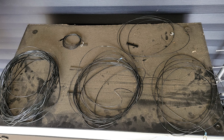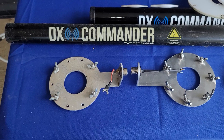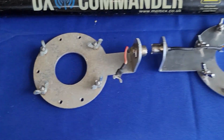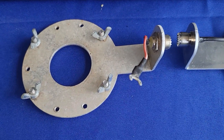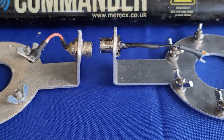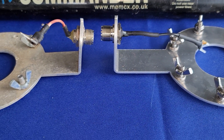So I'm going to reuse the 80, 40, and 20 D10 elements because there's nothing wrong with them. But I did make up some new 10 and 6 meter elements with the new DX10 wire, put on the spade connector, crimped it, and also added a little bit of solder. I also made up new radials — four sets of five radials — and crimped the spade connector and soldered it. We showed that in the first video and in several other antenna videos as well.